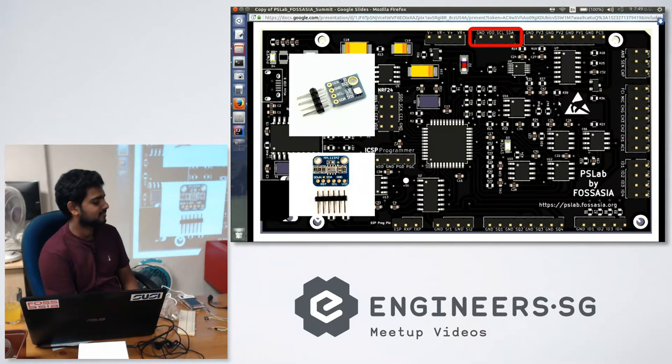So actually with the breadboard, we can already attach dozens of devices right now. If you don't use the breadboard, you can attach one. In the next version, we will extend this. We have four more pins, because we realized we have space. But already now, if you use a breadboard, you can attach a lot of devices. So it's very good for prototyping or for some science.